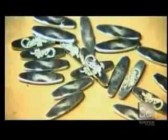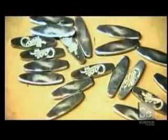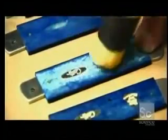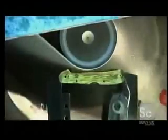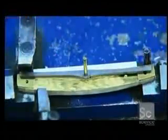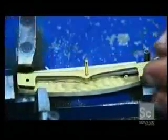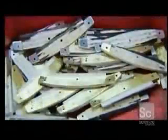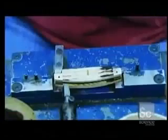Using epoxy adhesive, workers decorate these pieces of bone with embellished metal inlay. Then, they trim the excess bone so that it's flush to the metal liner. Next, they place a spring on the underside of the bone and brass part, followed by a rocker arm and a spacer. This sandwich is finished off with another bone-covered brass liner.